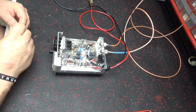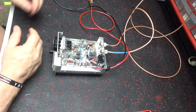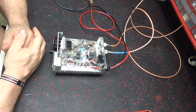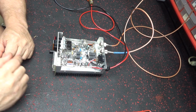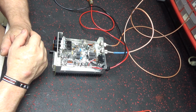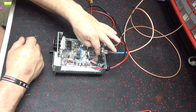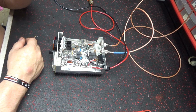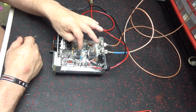I normally like to bounce stuff like that off people, and I don't mind if they bounce it off me. Ideas of what could be wrong, to get it fixed in a hurry instead of having to check and recheck. But like I said, I done already pulled the output cap out, checked it. This cap here was an 82. That was more than likely the problem with it to start with. I don't know why they done that, but I checked the 330s here.